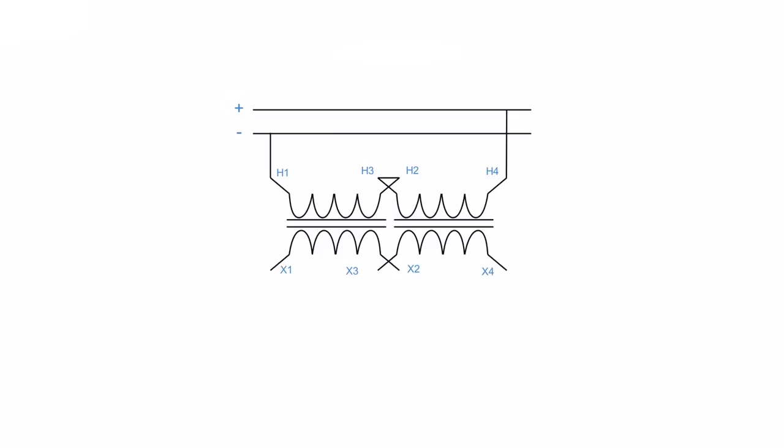Now with the primary, it's all about the lines of flux. So what happens here is, as my current is flowing across this winding here, it loops around and flows that way as well. So current is heading in the same direction, which means that the magnetic lines of flux, this flux and this flux, are adding together, which creates an overall flux, which is important because keep in mind that in a transformer, the windings are just wire, just wrapped in a coil. So because it's creating this massive amount of flux, it creates a big, huge counter EMF, which pushes back on the current. So we don't actually see hardly any current flowing across here. You see a minimal amount, 2 to 5% of your rated current flowing through this. But for the most part, we consider that to be negligible. We see no current flowing through here. That's because this flux and this flux are adding together to create a counter EMF that pushes back on the current.